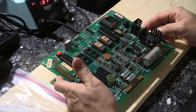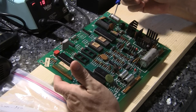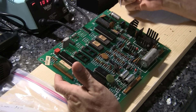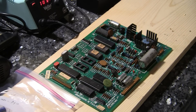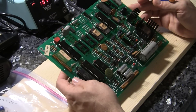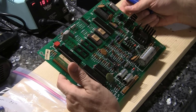Another thing you can do when looking over these boards is physically examine the capacitors. Not all components that go bad will look different, but sometimes with capacitors, if you see any that are bulging, that's a sign that there may be problems. If you see any capacitors that are bulging or look like they're damaged, that's always a good sign to replace them.